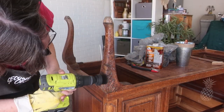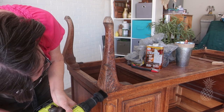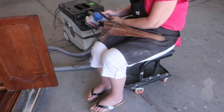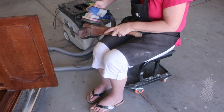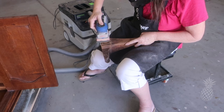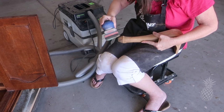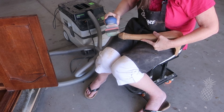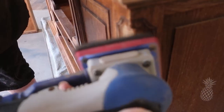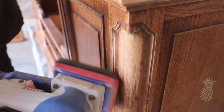This is where I got stripper all over myself because that little brush head just kind of sprayed stripper onto my arms and my feet. The burn! On the first pass, the stripper didn't take off all of the finish. So I pulled out our handy dandy surf prep sander and started sanding around some of those details. This sander is so handy for getting into really little detailed curved places - it has sponge sandpaper on it and works very well.